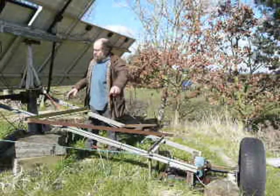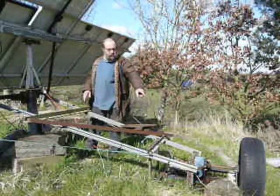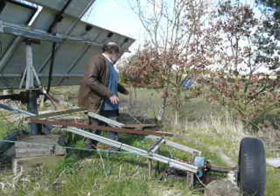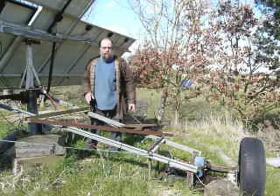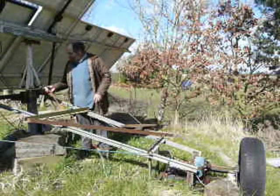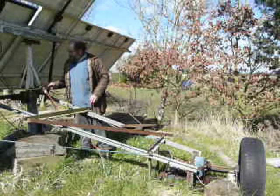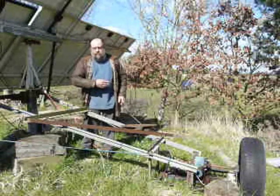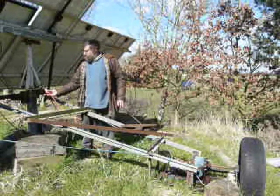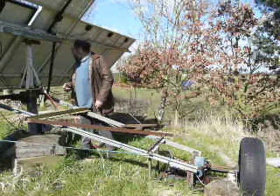Eventually I can move that micro switch up here, and then those blocks can get sunk a bit further so we can mow across there. The problem with the micro switches down there — apart from somebody moving the block — is that last year I had to mow this several times because there's a load of tansy and thistles here, and they were growing up to the point where they were operating the micro switch. The other interesting bit is that here we've just got a standard two-pin socket and plug, clamped there and there. So if for some reason this whole thing continues on, it wouldn't go more than about three foot and it would pull this plug apart — so the power is removed by the action of that whole thing moving. Same way the other direction.